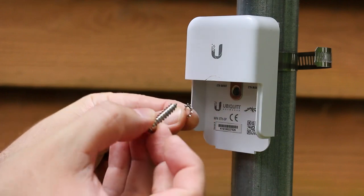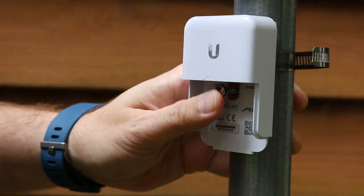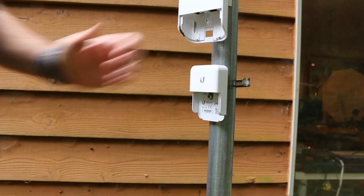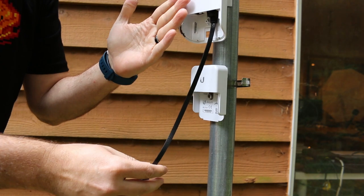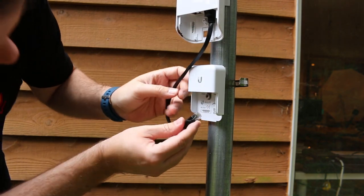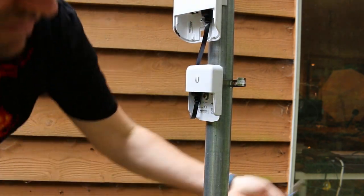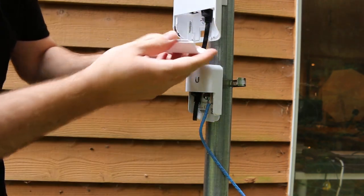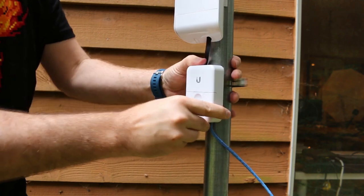Next, take your washer and the screw that comes with the ETHSP and put them right in the hole and screw it in. Then we're going to plug into our nanostation — plug it into main. I'm using a nanostation in this example, but this protects any outdoor equipment. It's a very good idea to have on any outdoor equipment. You can plug into either side of the ETHSP — it doesn't matter. Then plug in the connection going into your office into the other side. Strap everything back up and there we go.